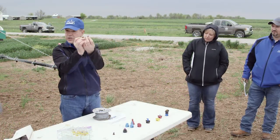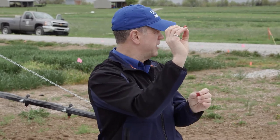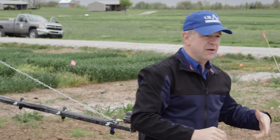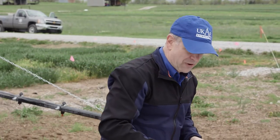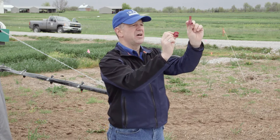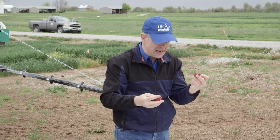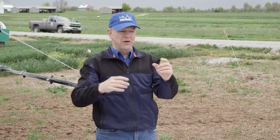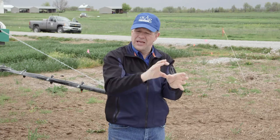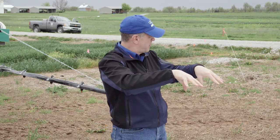These are twin jet nozzle tips — two jets coming out. But if you look at the side of this one that's a little fatter, it's got a hole in the side where air can go in. This one does not. Same size, same flow rate at the same pressure — but we get different droplet sizes out of them. Here's another format of the same thing — two nozzle tips, same size, but this one has a long inlet and a hole on the side for air induction. As water comes through and goes out through the nozzle tip, it breaks up into little droplets.